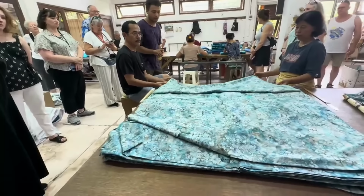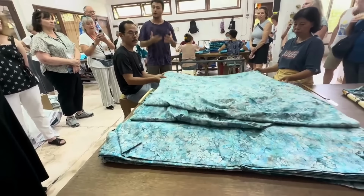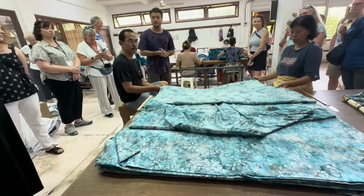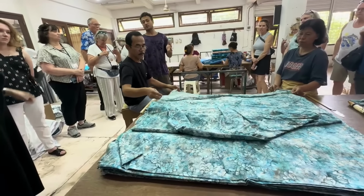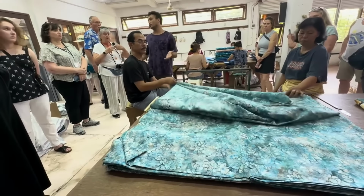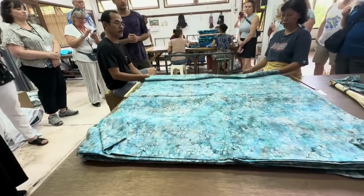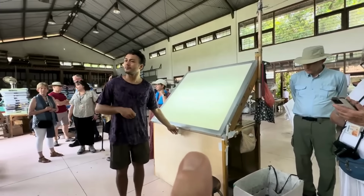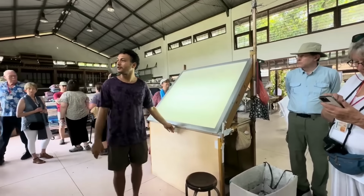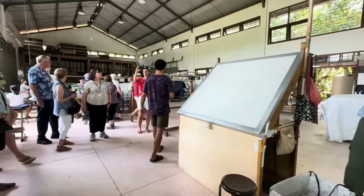Fabric. Look for any burn marks, leftover wax. Sometimes water glass doesn't fully get washed out. And any defects in the fabric in terms of color or motif, because sometimes they can show us one piece of fabric that looks really good, but in a batch of maybe 120 yards, you'll get something that isn't quite matching the rest of the fabric. So this is the first step. This is a light bar. I missed the first part of it, but they put the fabric on there to look for even more possible flaws or issues. So look at the coloring.